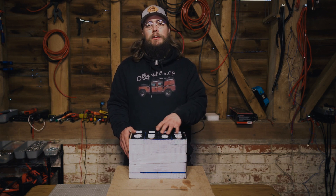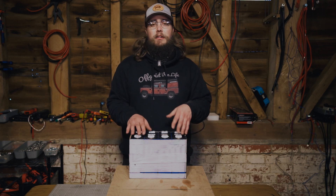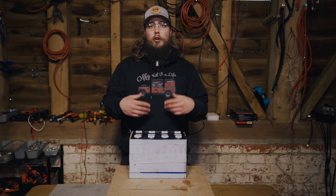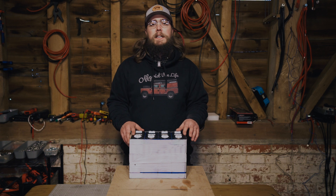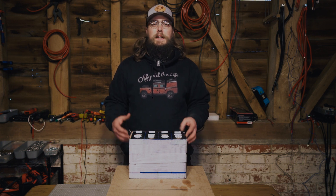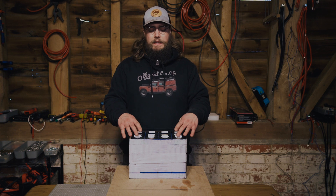We've probably lost about 10 amp hours of capacity through the damage — not too bad considering the level of abuse these cells endured. If you're wondering whether you've damaged your cells by shorting them, the answer is probably yes, and the level of damage is likely dependent on how badly and how long they were shorted. These cells have also very clearly been rolled over and probably dropped upside down, judging by the damage on the casing, and the internals have probably moved around — contributing to that capacity drop.